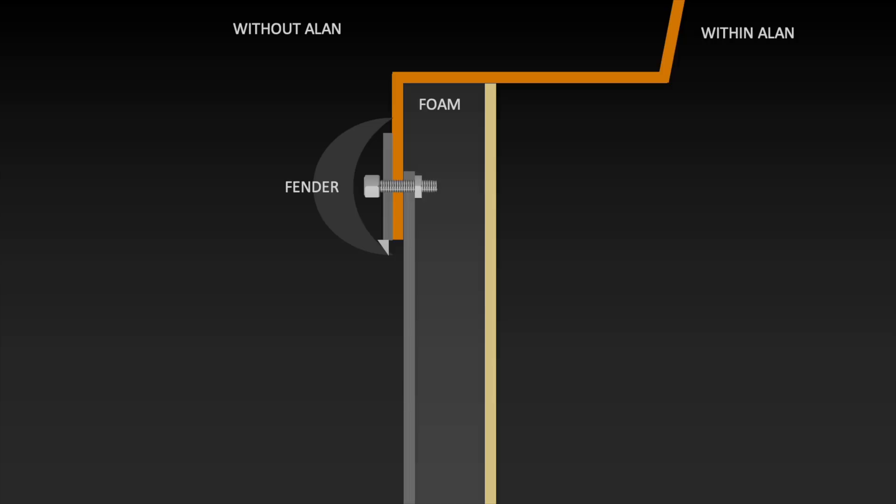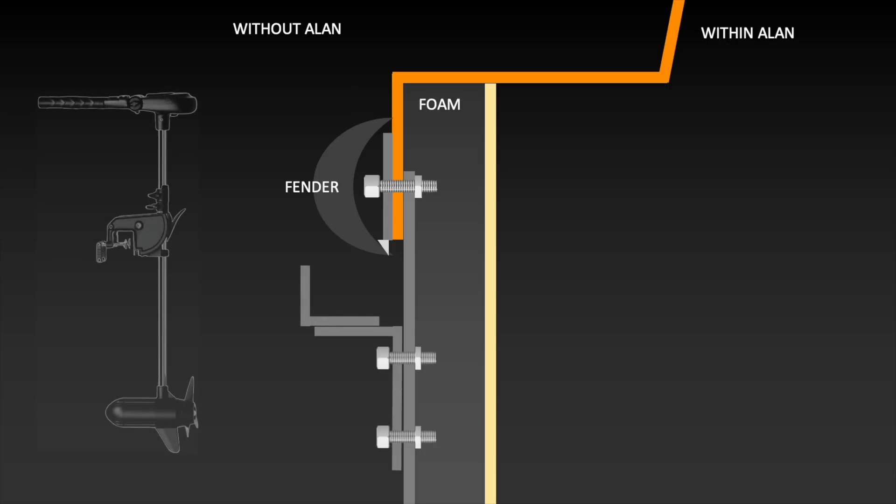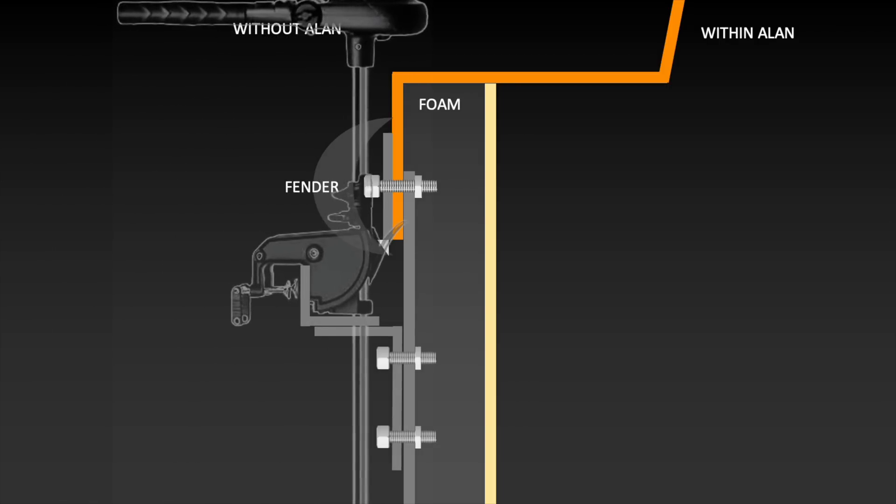You may be wondering: why angle section? Why not flat bar? Why not box section? Well, the right angle that won't be flat against the transom will be easiest to bolt or clamp things to, plus it massively increases the structure's resistance to bending.